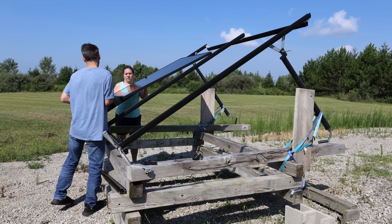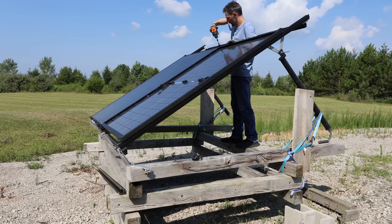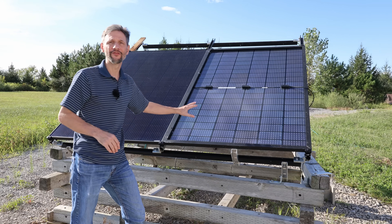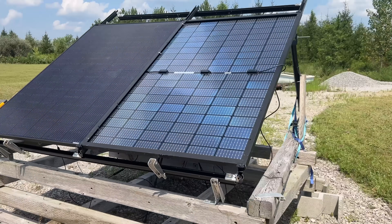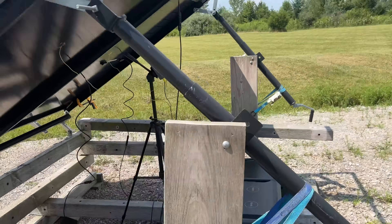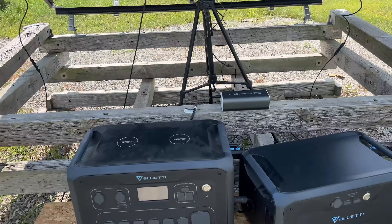I'll be sure and link to that in the description as well. I've mounted two panels here to this open rack from the batch that we installed on his roof to run some tests — one as intended with the face out, and one with the back facing out, so I can measure the max performance of the backside. I used my Fluke irradiance meter to measure the solar irradiance and connected each panel to an independent MPPT tracker on my Bluetti AC300. I'm using a data logger with K-type thermocouples to measure the backside temperature for each panel, as well as the ambient temperature. I'm checking the full panel output and running a test with the backside blocked so I can measure the front and backside performance independently.